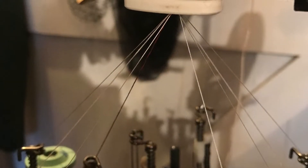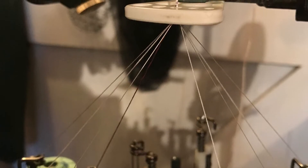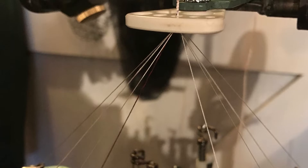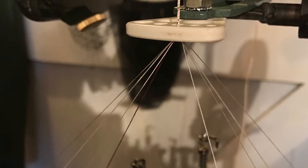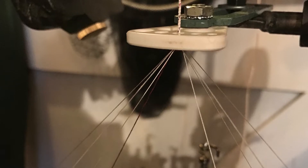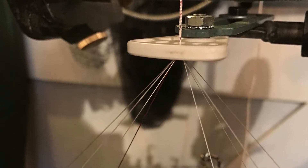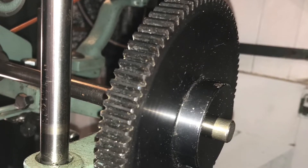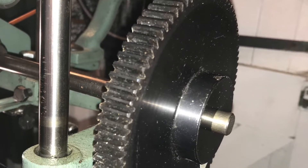Silk fly lines are made thicker or thinner by increasing or decreasing the silk thread bundle. To make a thicker silk fly line, the maker uses either thicker silk threads and/or introduces additional silk threads by engaging more carriers and bobbins. Gears at the side of the take-off rollers determine the rate at which the silk threads are dragged off the rotating bobbins by the take-off rollers.